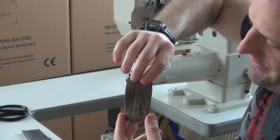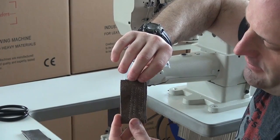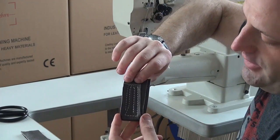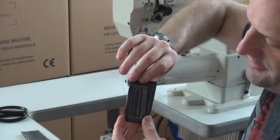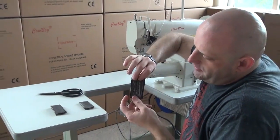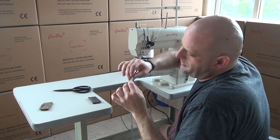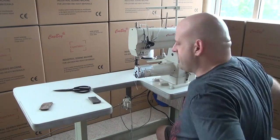If you flip the piece over on the back side, you can see that the stitches are pulled up very, very nice in the center of the three layers of material. You can't see any loops or nubbies on the back side. This machine is a very good machine for sewing with 138 and quite possibly a 207 thread through multiple layers of heavier weight leathers. We're going to go ahead and try this now on four layers of upholstery leather — again this being three to four ounce — so you can see how the machine performs.